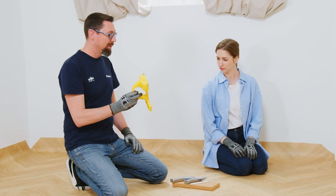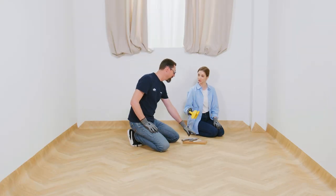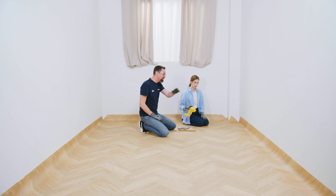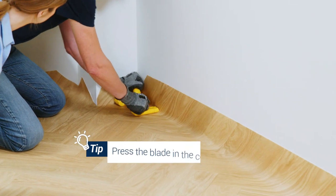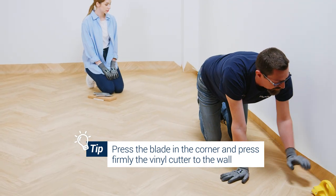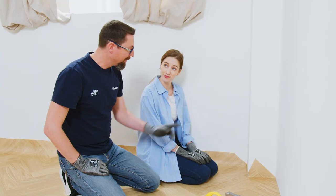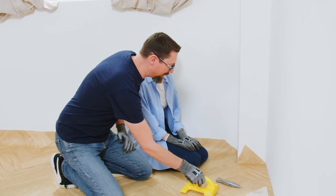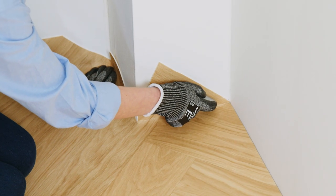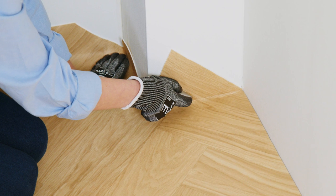As we have done all the corners, we can start to trim along the wall. For that, you will use a special tool called a vinyl cutter. I've never seen that in my entire life. You will see, it's far easier than using a knife. We will start from this corner — I will show you how to press it and you will just push it all along the wall. Here on this small piece of wall, we won't be able to use a vinyl cutter, so in this case you will use the knife with the hook blade. You will place it in your hand, press it with your finger, go inside the corner and just cut it.